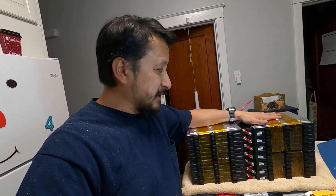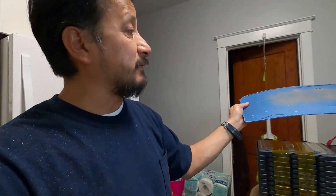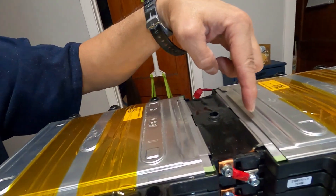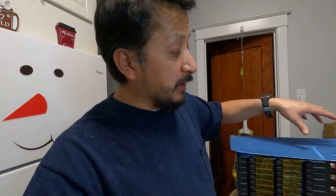If you charge lithium-ion without a battery management system — nothing to regulate the voltage — lithium-ion batteries cannot be overcharged. If you overcharge them, they will ignite and explode. That's also why I made this plastic cover for the top of the batteries. They're going into a cooler with air vents to protect them. If you drop a tool and puncture these chem pouches and break through the metal casing, oxygen will ignite and start a fire.